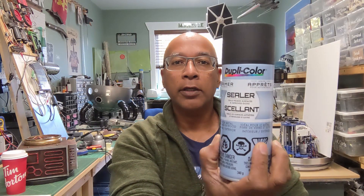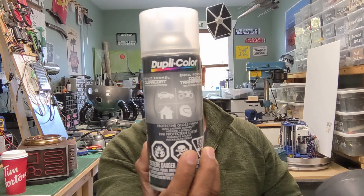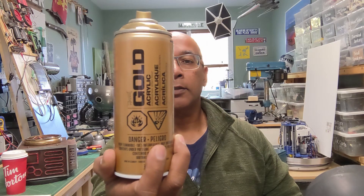Well folks, that's episode number five. I hope you enjoyed watching how I made the base station and did all the wiring. In episode six we're going to be putting it all together — you'll see an animated C-3PO. In the meantime I've printed off another head. I've been using Duplicolor primer sealer and taking it down with about 1000 grit. Once I get all the little imperfections out I'm going to cover it with Duplicolor gloss finish and then follow that up with Montana Gold spray paint. I hope you can join me again next episode. Thanks for watching.